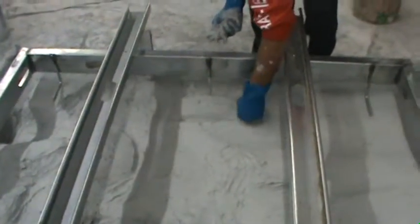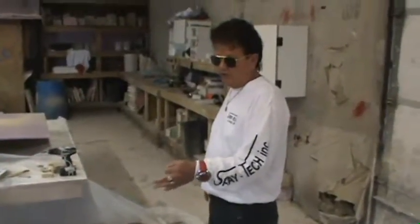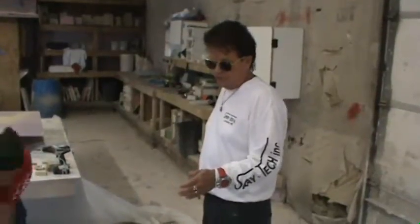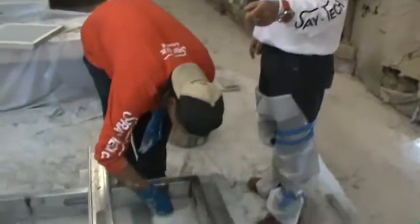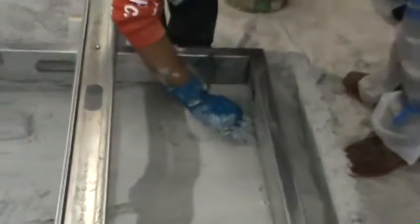This is a galvanized steel frame. So the best weld you can use for welding this is CO2. That works great for welding galvanized steel. The flex anchors are electroplated. That's what they have to be for PCI standards. The pads should never be round. They should be exactly 4x8. Anything out here does nothing for what you're trying to do. It just wastes material, exactly square, 4x8.